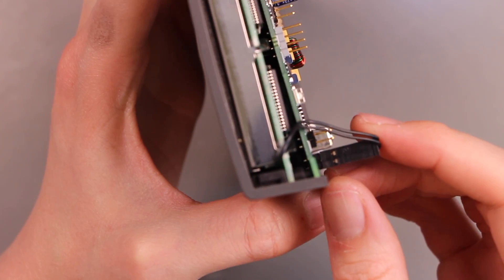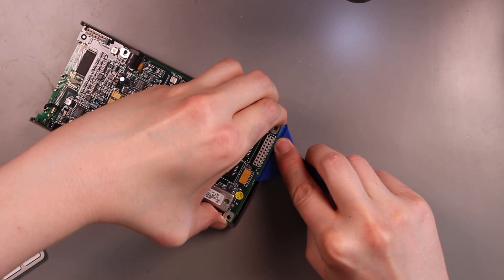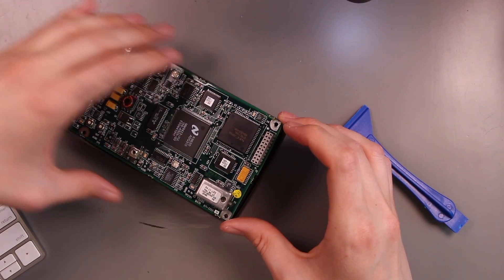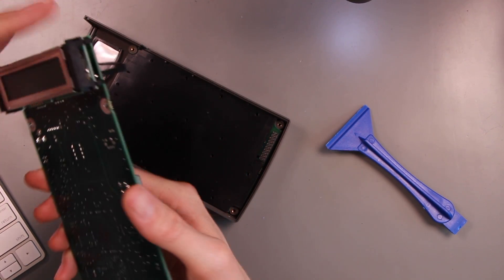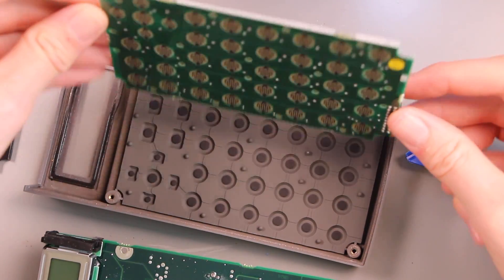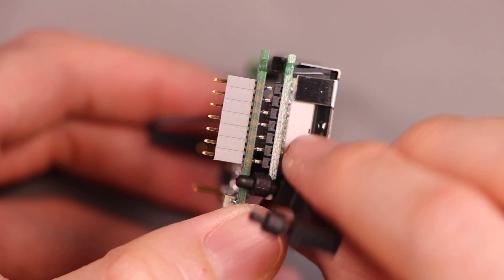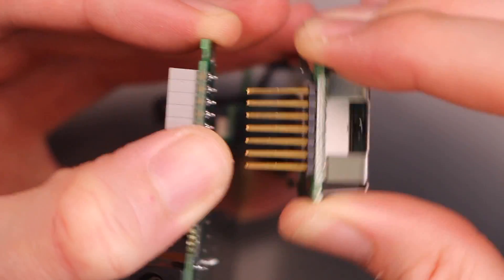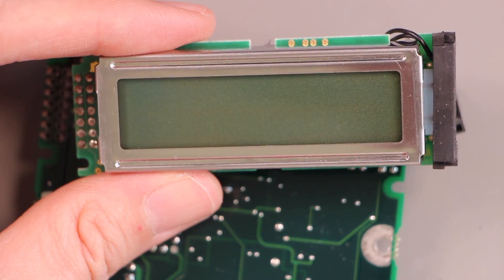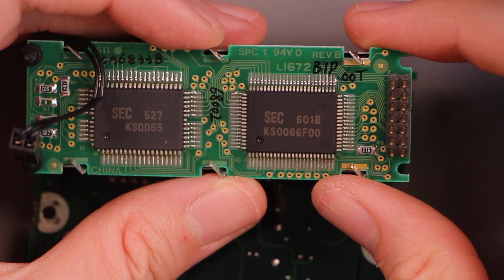There's a wire going down under — is it possible this has a backlight? That plug is definitely a backlight; I didn't see how to activate it, that must be something in software. The other side is utterly boring — mundane but beautiful. Some little buttons, a nice little latch to hold the LCD down. So this is pretty interesting: it has an ASIC, an 8-bit CPU, and a DAC with pretty nice filtering. You could make a pretty nice retro arcade console out of this — it would just likely have Atari 2600 style graphics, since I don't think this has sprite logic like the Atari did.